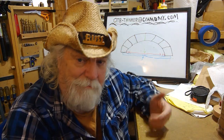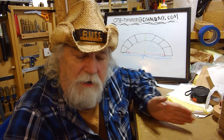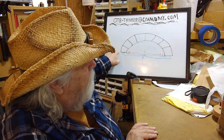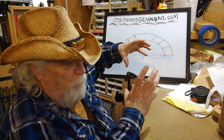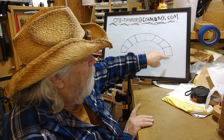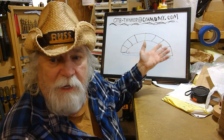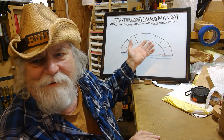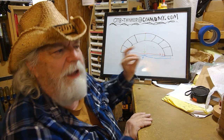You've got to go watch his video — I'll leave a link in my description box below. Go watch his and come back, and this will make more sense when I explain how I relate to what he did. Basically, he's trying to clamp this up with a band clamp. If you do a full circle, you can put a band clamp on and everything pushes inward evenly to bring it together on the joints. But if you're only doing a half circle for an archway — especially a big one — you don't want to build a whole circle and then cut it in half.